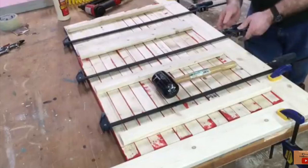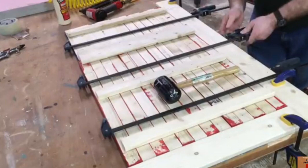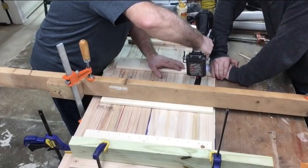If you're making just one or two flags, this type of arrangement will work well, where I just took two pieces of scrap wood, created a square on my workbench, and was able to secure the flag there. However, if you're planning on making more, then you know you're going to need to have a dedicated jig.